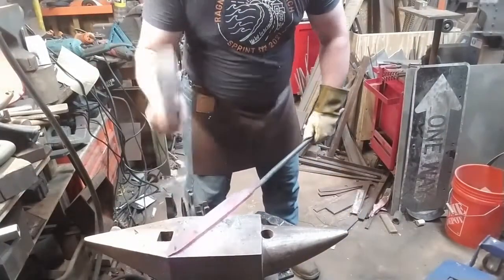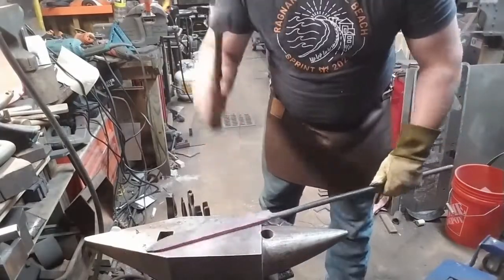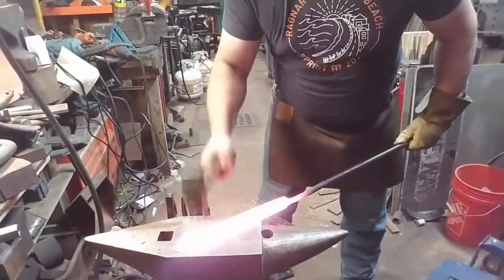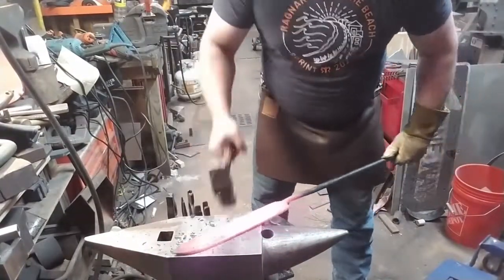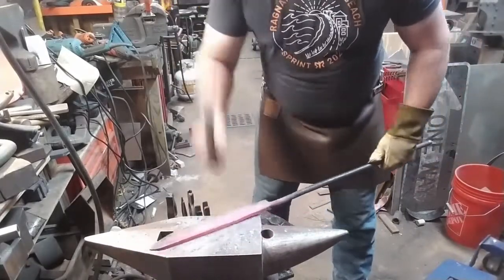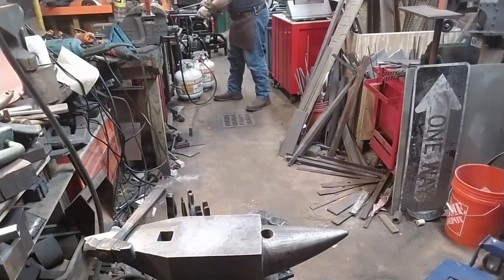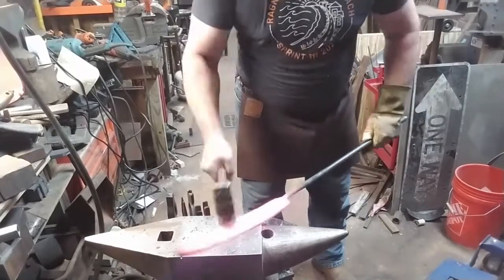Ultimately, if you have a seam that fails, the best thing to do is to cut it off and work with a smaller billet. And that's exactly what I wind up doing. I think I do that off screen, but I'll be chasing this seam around for a little while. I think here I've just cut it off. And it behaves nicely for the rest of the build process. I lost about a half an inch. But that's okay. We have plenty of metal to deal with. We'll have a very nice, healthy sized blade.